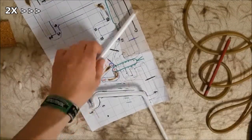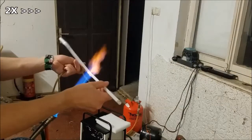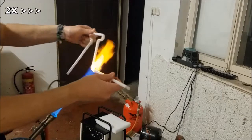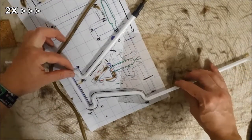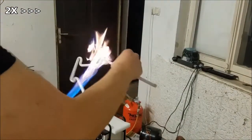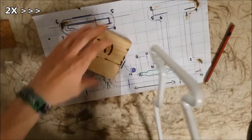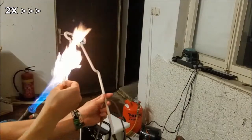Corner cooled down again. See, I tangled up the blow hose around the tube again. Now I'll bend that portion with the 45 degree short piece going out and then the rays going up to connect to the inner part of the A, and I'll try to do that in one heat, the 45 degree bend outward and then the double back going into the crossover.